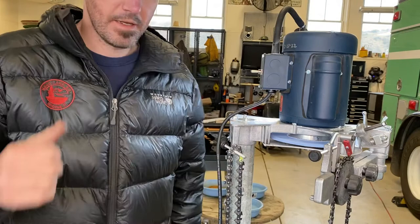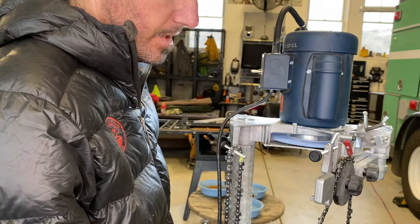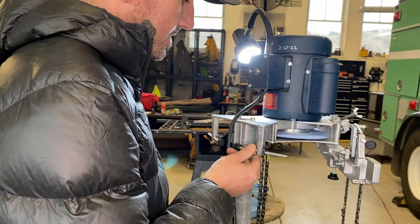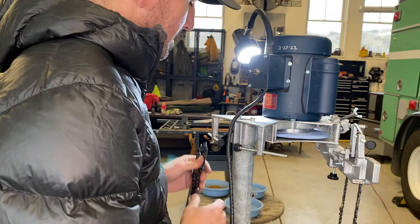It's definitely a learning curve — it's not like a round grinder where you set it up and go. There's a lot of adjusting and tweaking. I got it set up for this chain, but the other chain I'm gonna sharpen next might have longer or shorter cutters, so I'm gonna have to tweak it a little bit. That's where I use these stops with the wing nuts, just to make sure everything's the same.